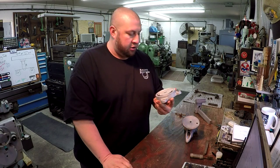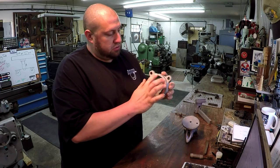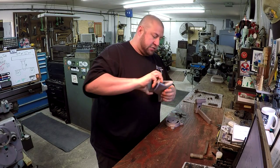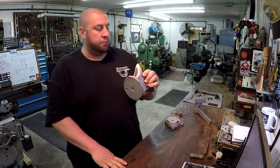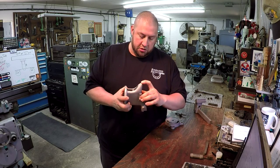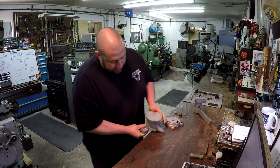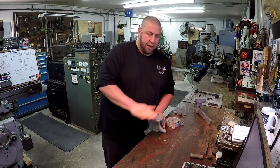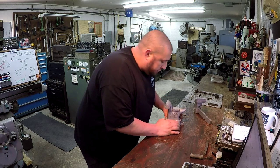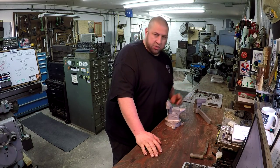This here, I haven't put a straight edge on it yet or anything. This one here would be really easy. I think what we'll do is we'll chuck this one in the lathe and we'll just true it up and we'll make a face cut and make sure that this is completely flat. All right, the main body of the vise here is gonna be a little more tricky. I would love to chuck this thing up in a lathe and face it off that way, but you could get two on there easy. The other two may be a challenge. I don't know. I might look at it and see, but if not, we'll probably just go to the mill and clamp it down somehow like this and just take an end mill and just run back and forth and just face that off just so that we can make it flat. You know that bolt's going to pull it down. So that's something that we're going to be working on and kind of improve on the original build here. Okay. So I'll be showing you that too.